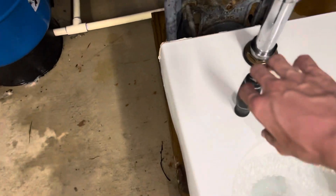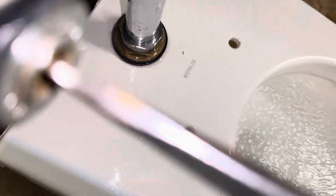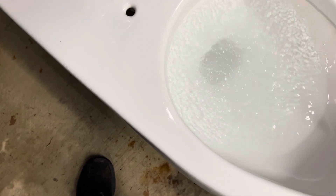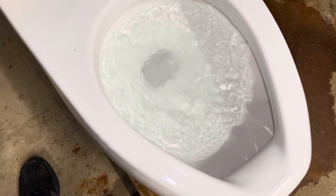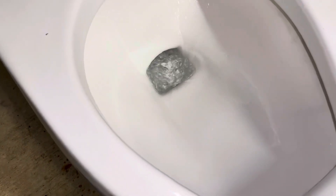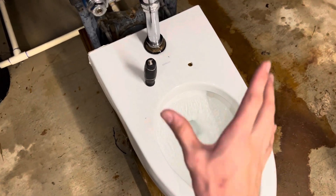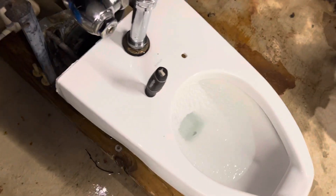Now I'm going to turn the flushometer off so I can put the 1.6 diaphragm in. I kind of have to push this thing in pretty hard. The flush is going to be super weak now — it might not siphon, it might not have enough pressure. There it goes — awesome. So that might be how it would flush on a tank, basically not siphoning. I'm pretty sure a few years ago, Lil Cinnamon actually tested one of these on a gravity-fed tank and I believe it siphoned. I definitely want to test that out.